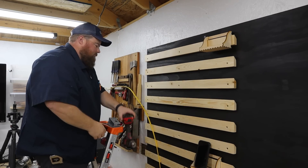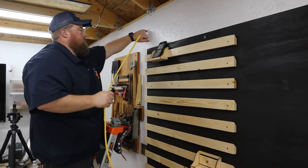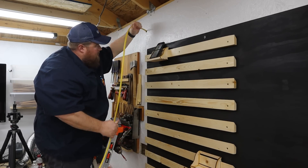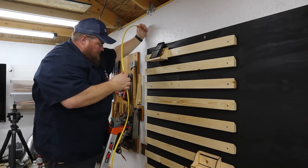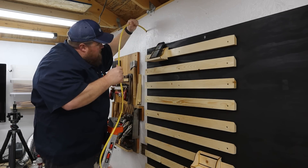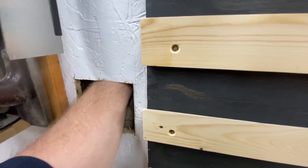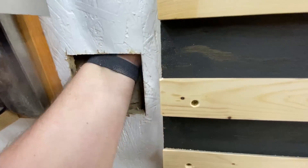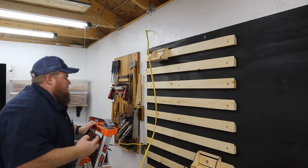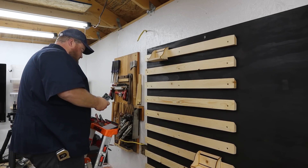As I'm going along the workshop, adding my new junction boxes at the top of my wall, I am being very careful to drill the hole to fish the wire exactly seven inches down from the top. That's going to allow me to make sure all my boxes are the same height. And when I add my conduit wires connecting the boxes, it should be perfectly level and look as clean as possible. The reason I chose seven inches is so that I knew I was well below the top plate and any blocking I had put in place, yet still give myself plenty of room to add things, or convert one of these junction boxes into a wall light or outlet. It's also going to be well out of the way of any storage lofts I build up in my ceiling, and give me room to still insulate, finish, and cover the ceiling.